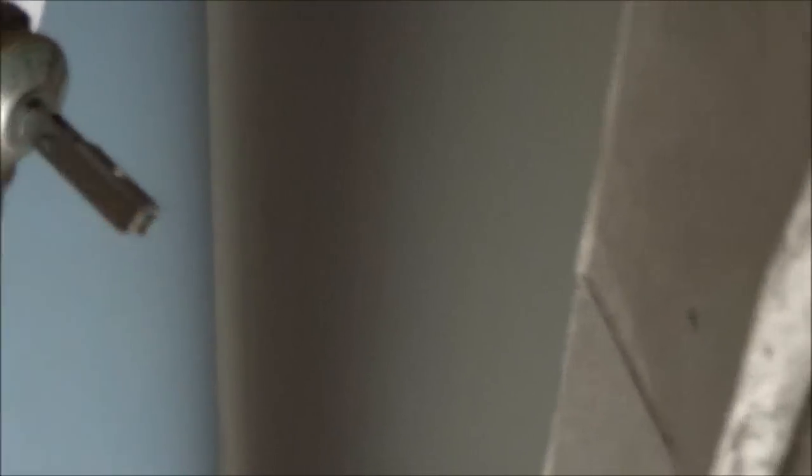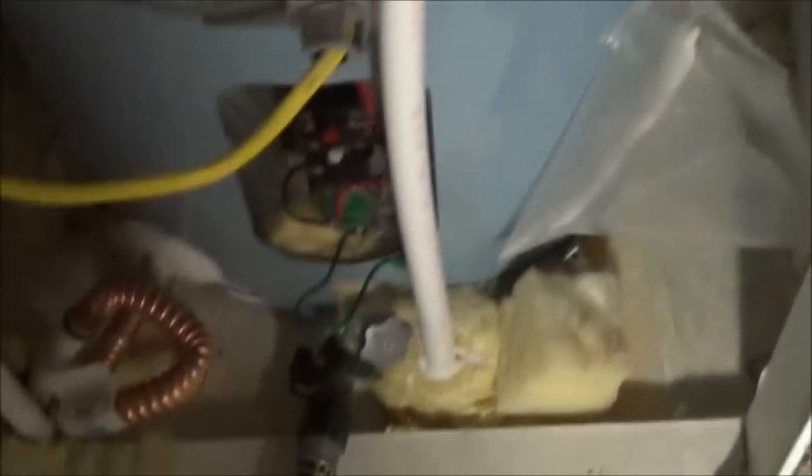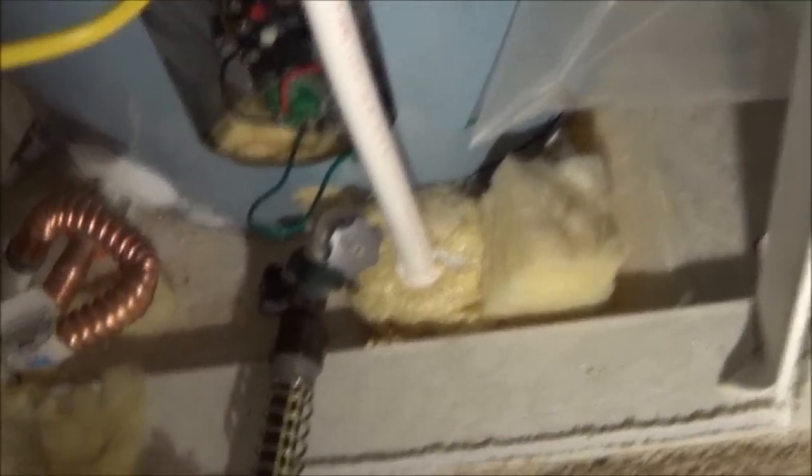Once you're complete and you've got it finished flushing and the water is turned off, you can turn on your emergency valve and let it bleed through to get the vacuum out. You'll probably hear it gurgle a little bit, then go ahead and close your valve back. Now you're ready to fill the hot water heater back up. Turn the water back on, then turn that back off, and now we're ready to fill the tank back up.